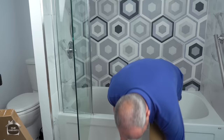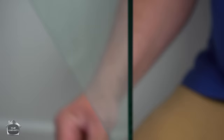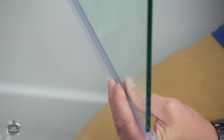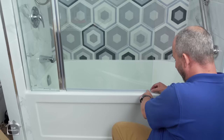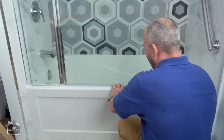Before we go in and set the other screws, we're going to finish installing all this stuff. The profile of this gasket set goes in the glass down here, and we're going to press this in place. That gives us a nice seal on the tub. Now if in your situation it's not closing properly, you can always take the edge of this plastic and push it down off the glass just a little bit, because it's actually got a lot of glass in this track. Make sure you've got solid contact with your tub — there's nothing worse than having a gasket that doesn't keep the water out.